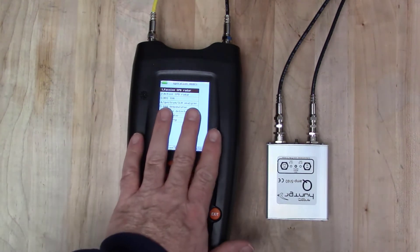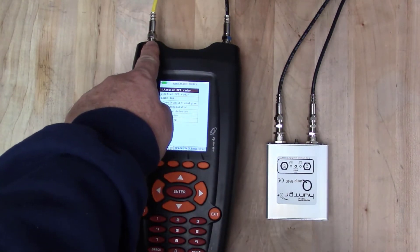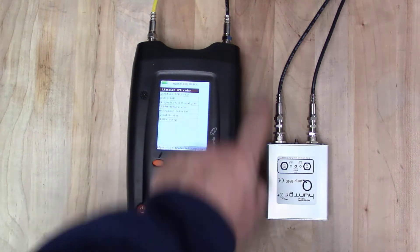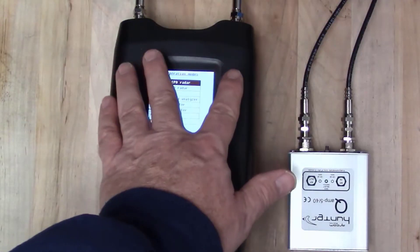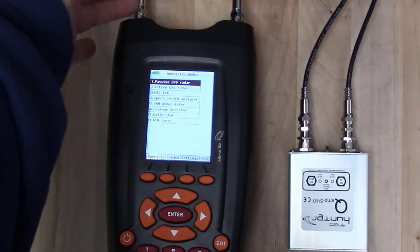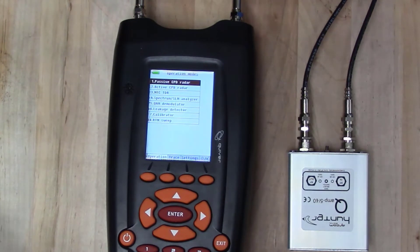On the Quiver there are two ports: the forward port connecting to the forward path of your amplifier, and the return port connecting to the return path of your amplifier. I have two different color cables on the two ports so I can easily tell which cables are going to what port. Yellow is forward, black is return. Your colors may vary, but have something that's different.